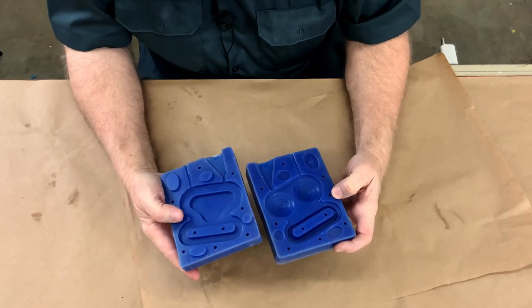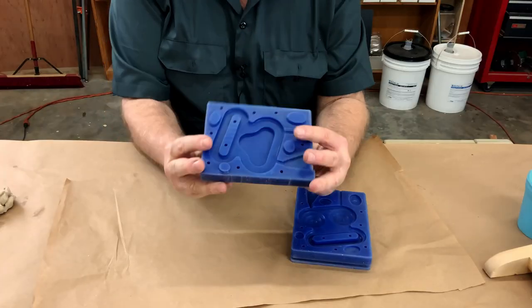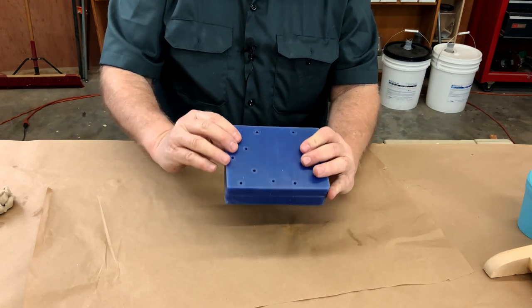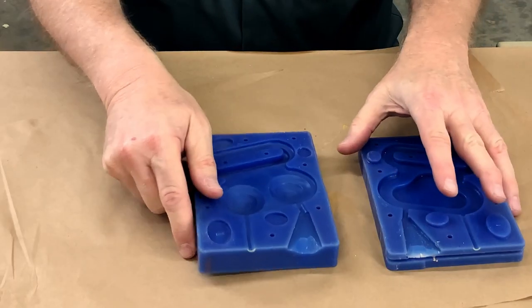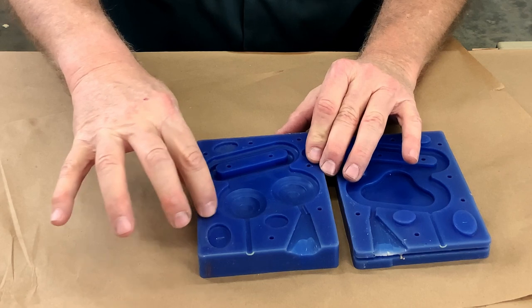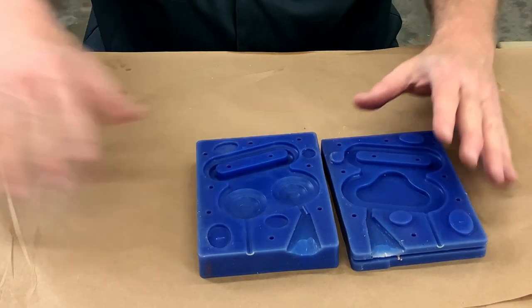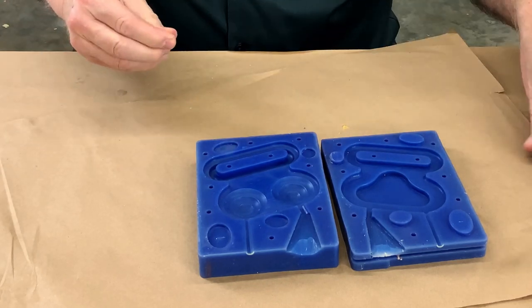I'm going to show you two ways to cast this today. I made these molds a long time ago, and you can see all the holes — all these holes are through holes. Originally when I designed this mold, I bolted it together with through bolts. There were a lot of problems with that system, not the least of which was when you get flash, you get flash around each and every bolt, the threads clog up, and it's a lot more hassle than it's worth. It's also a very slow method.